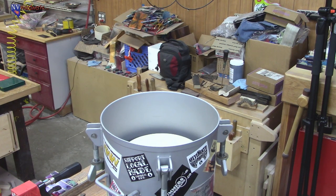Yeah, vacuum sometimes works, but the problem is if you're using a resin that has a solvent in it, vacuum is going to lower the boiling point, and so it ends up just boiling in there. It just doesn't really work well with vacuum, with resin casting in general. So just kind of watch that. Pressure is the quickest way to go.